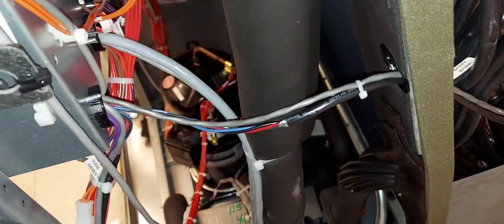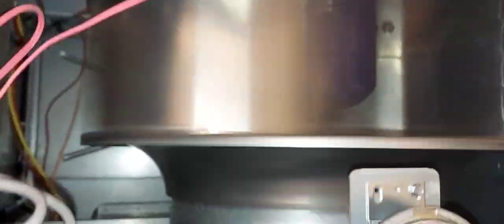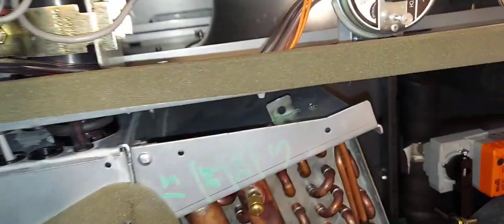The other switch in the front is the airflow switch. Here is a high temperature reset switch — I suppose that's the way they're doing it on this newer unit; on the older type it's a different switch down at the bottom. There are also some additional common alarm relays and such over here. If you're a beginner this will be out of your reach; if you're a pro you probably know what these are — leave questions in the comments. Here's the evaporator fan — you can see it's running right now. It's a DC fan.